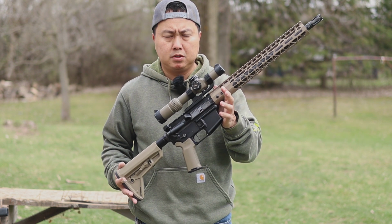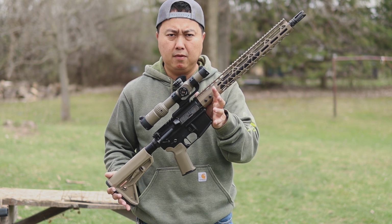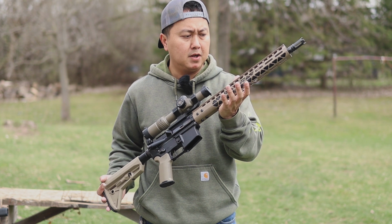Again, it's very important for you to torque to specifications. I believe Guntec USA says anywhere from 30 to 45 foot-pounds. I got close to about 42 and it lined up just perfect, so I left it at that.